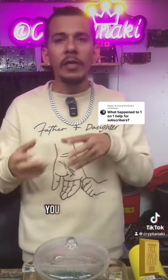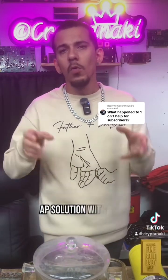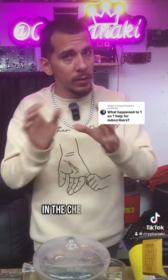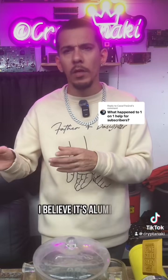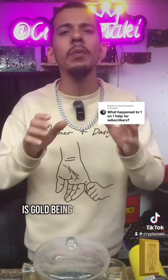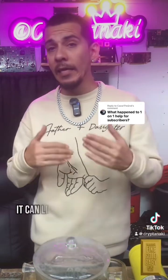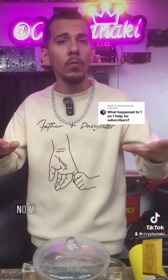You cannot cement copper out of AP solution with gold — it just doesn't work that way chemically. But you can use iron, and I believe aluminum as well. What we're talking about is gold being liquefied into the AP solution. Yes, it can liquefy your gold over time if there's no copper left from the boards.